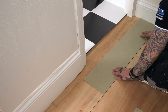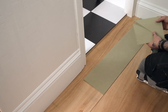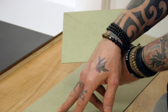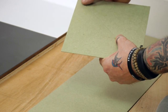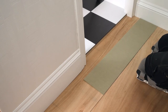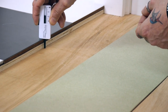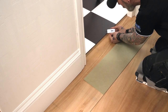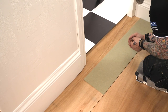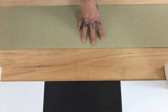That gives a straight gradient up to the floor covering. As we'll be coming away from the doorway as well, I've cut a side shim — one shim will produce two side shims. Using the drop checker, I can see that gives me a height of 21mm. I've got a 10mm carpet and I'll be using the Stairrods Geordie gripper which is 9mm, just to give a nice smooth transition through the doorway. That 10 and 9 gives us 19mm.